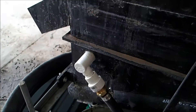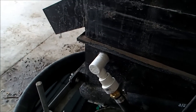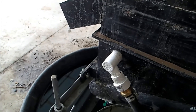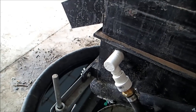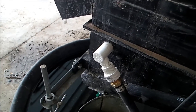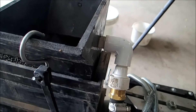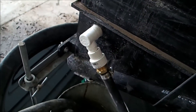Now all of this stuff is a balancing act. You don't want too many cons, but you don't want to reduce the cons to the point that you're not picking up the small gold — and especially the flour gold which tends to float pretty easily. What I've read suggests that you want a third of the water going in that flows across the bed and you want two-thirds going in under the hutch.